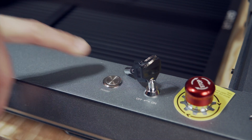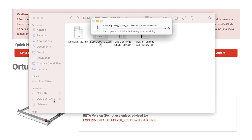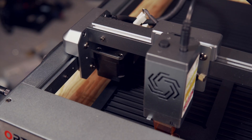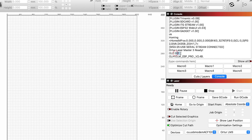The lights around the power button will begin to cycle between red, blue, and green, letting you know that you are in upgrade mode. Back in your Finder window on Mac or File Explorer window on Windows, the Ortur will show on the left as a mounted device named OLM3 Update. All that is left to do is drag the firmware update .bin file over to the OLM3 Update device. The transfer should be fairly quick, and as soon as the transfer has completed, the laser will update itself. This whole process should take no longer than a minute, and upon completion, the Laser Master 3 will restart and home itself. If you still have Lightburn open, close out and reopen it to connect to the laser. You can check the Console tab again to confirm that the laser is now running the latest firmware version.